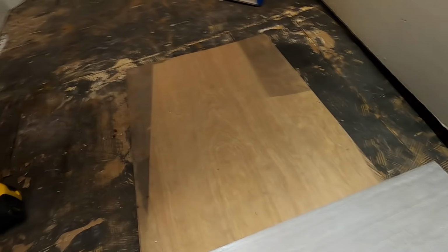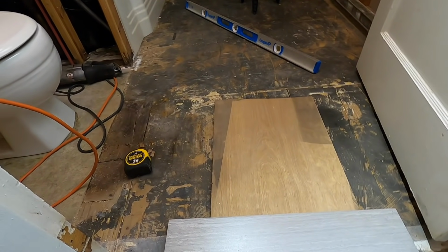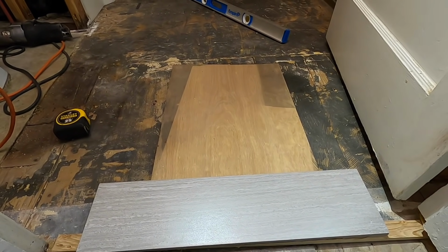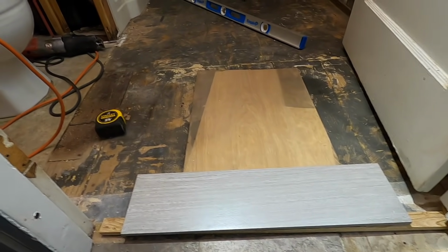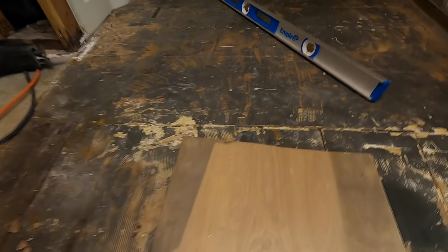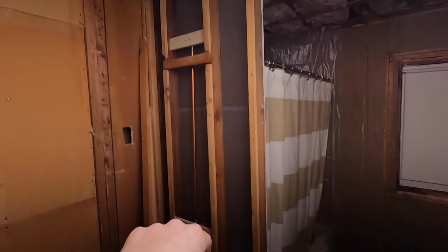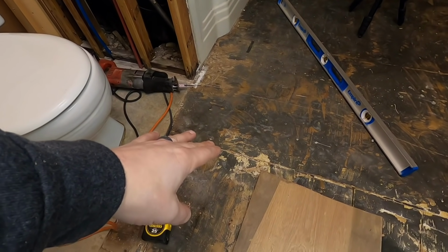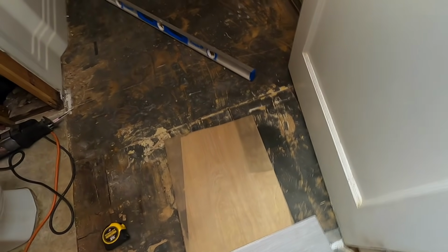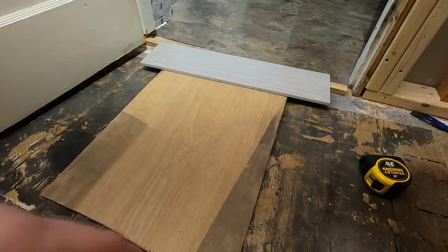So, unfortunately, what I'm gonna have to do is rip up this floor. This is 3/4 inch on top of 3/4 inch. So there's, you know, the main floor underneath it. So I'm gonna have to rip this stuff up and see what's going on. I know that right here, you can tell because that's where the beam is, that is the old house, and what's happening is this is just sinking. And I went in the basement and looked, and there's no real way of jacking it up over there and making it level.